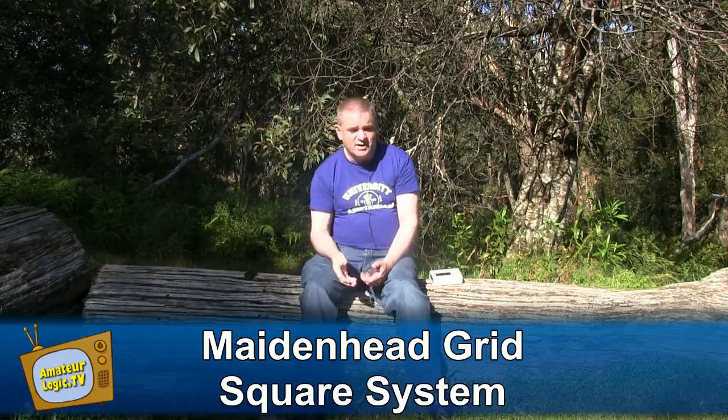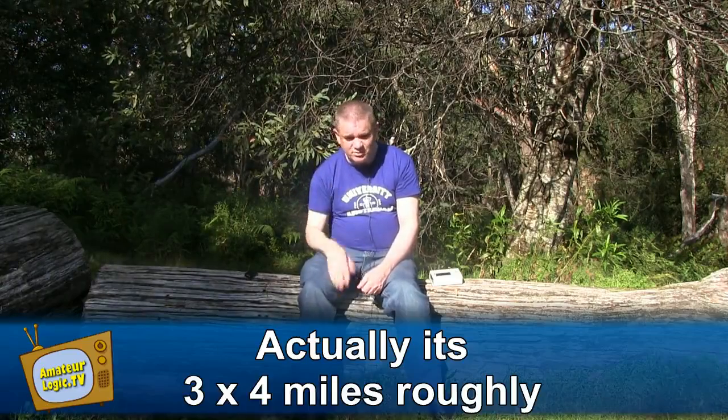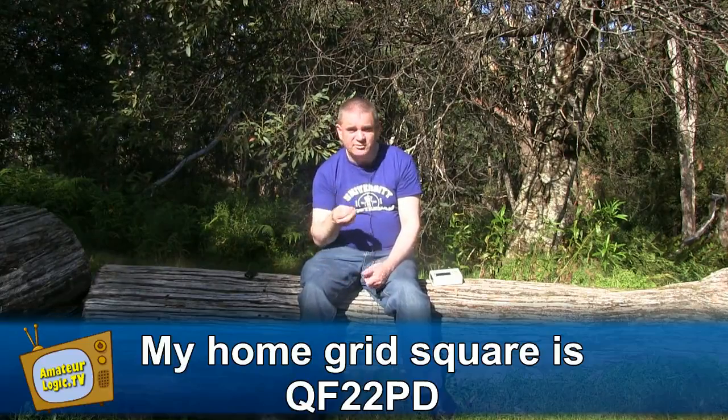Now, you can give them your latitude and longitude, and you can probably get that from the GPS on your mobile phone, but amateur radio operators tend to use a grid square system called the Maidenhead grid square. It divides the world up into 18 by 18, then that's subdivided into 10 by 10, which is in turn subdivided into 24 by 24. What you end up with is a little square, which is a couple of miles by a couple of miles, approximately, and it's 6 digits long. And so it describes a region, not a precise location, but it's really useful for giving people an idea about where you're located. So at home, for example, my grid locator is QF22PD.